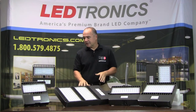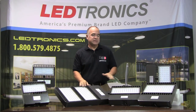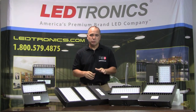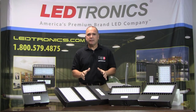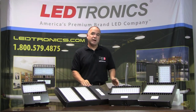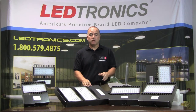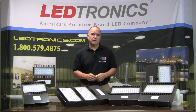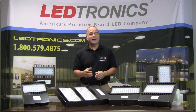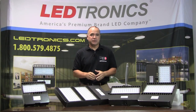This carries a U.S. factory LEDtronics five-year warranty. They're DLC listed, so you can look for rebates in your local utility boards. Some of the options that we have for our SBX series are dimmable drivers. We have a photocell option package with a 3 or 7-pin photocell. The 7-pin allows you to use a multiple range of wireless control systems too, so that's a really big plus for your project.